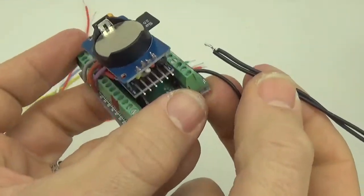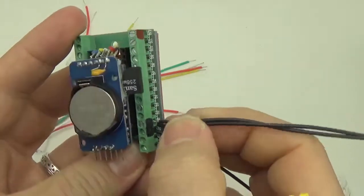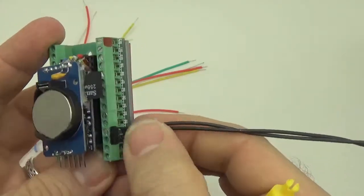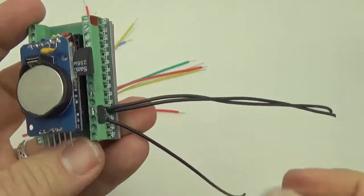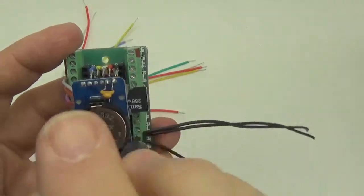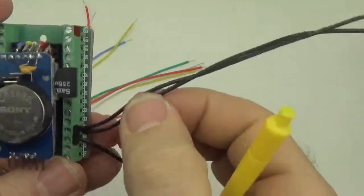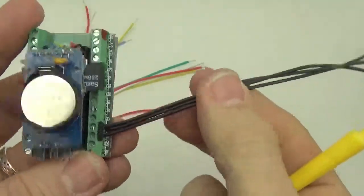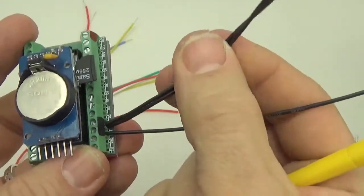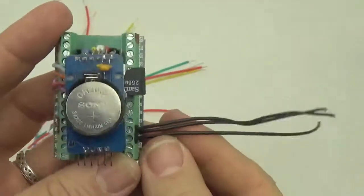You can add more than one wire to the same connector. Because we're going to have two I2C connections broken out on this unit, because you've got the Atlas Scientific and one of the pressure sensors, I'm actually going to break them out separately so you can double up some pins like that. So we're going to do that with the ground. Okay, so there's 3 ground lines that I've brought out with only 2 connectors. And we're going to do the same thing with the data and the clock line for the I2C bus, so that we have the ability to add more connections.